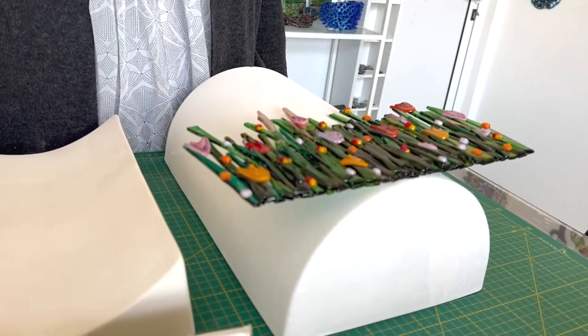It's going to have a long slow ramp because it's going to be quite close to the elements. This is quite a high mould, so if you're close to your elements you want to go slowly up, because otherwise there's thermal shock on the way up. And it will need a long anneal so that it's properly annealed coming down. So I'll get that in and we can have a look how it is when it comes out.